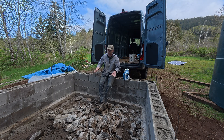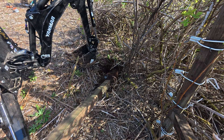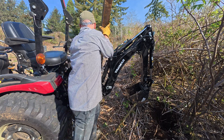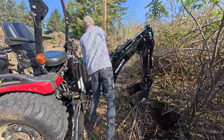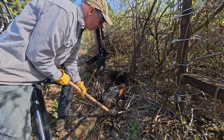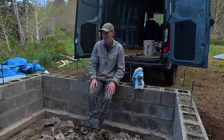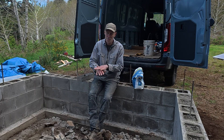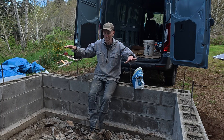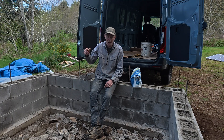This whole basin will get filled, and I want to fill it with something that doesn't compact very well. I've been pulling out fence posts from an old set of horse pastures here that are completely derelict — the elk and deer have trashed them — and I'm pulling out the 4x4s. I'll use those to repair a bridge and deck it. I'll break up the concrete on the ends of the posts and put it in this pile, mix it with some 3/4 minus, and compact it to create a really sturdy basin. This is really just a big block and we're going to set a tank on top that's going to weigh many thousands of pounds — 2,500 gallons of water at 8 pounds a gallon. These are the next steps, and all of this is for the water supply to feed the cabin.